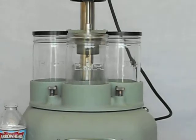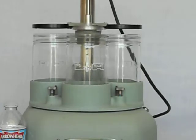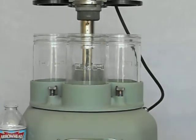Again, because of the spin-off delay, it will leave more material, or the rinse material, in the jar and move less of that forward to the next jar to reduce your contamination. And that's a feature that was incorporated into this cleaner. Cleaner's been fully stripped down. Everything's been checked, cleaned, tested for functionality, and replaced. So the machine is fully functional as it would be from the factory.